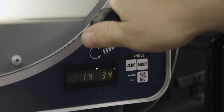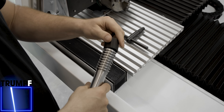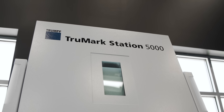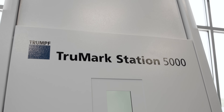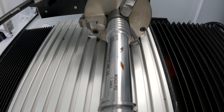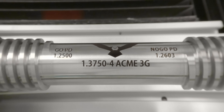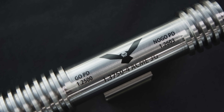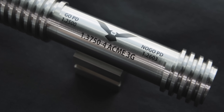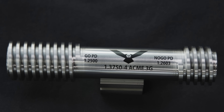Now we're going to get it over to Trevor and he's going to mark it up for us. We're over here at the Truemark Station 5000. We're going to take our thread gauge, load it into our rotary chuck, and laser mark our go side pitch diameter, our no-go side pitch diameter, and our thread type. We just finished laser marking Chris's Acme thread gauge using an annealing process so that it's smooth to the touch. We ground the gauge, inspected the gauge, and then laser marked it so we could easily identify it down the road.